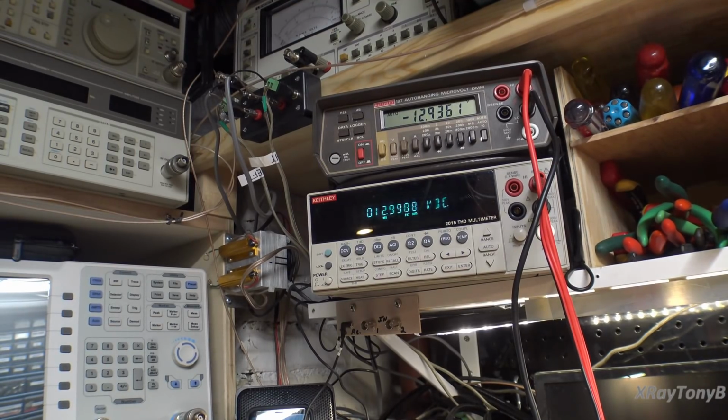So let's turn the variac on, and I can tell already from the residual voltage that there's no shorts on this channel, but we're going to power it up anyway to full power and see what we get. I'm monitoring the current on the amp meter, and as long as I turn it up slowly, it's only drawing milliamps. At about 48 volts, you just heard that little click, maybe, if the mic picked it up. That's the soft start relay coming in.